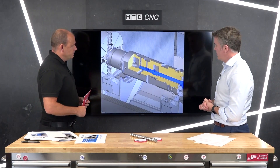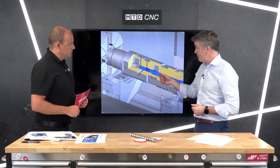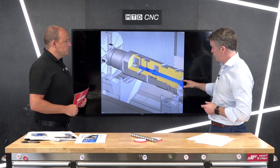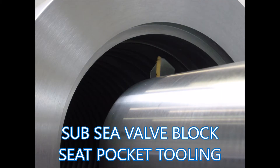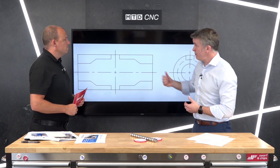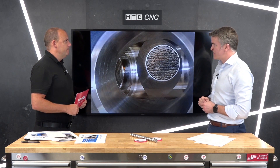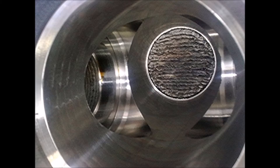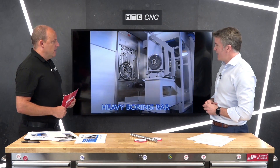This is a new feature on the MPMC range for doing seat pockets for the oil industry. You insert the tool into the job, then there's an actuator which simulates a quill on a boring machine, which will then move and allow the blades to move out into the job — so you can do seat pockets, back boring, things like that. Bear in mind that this is Inconel clad, so this is seriously tough material to cut, and the machine copes with it absolutely — no vibrations. It's a hell of an operation.